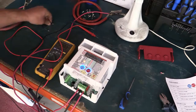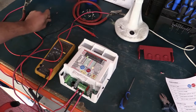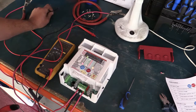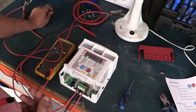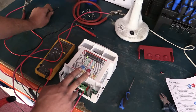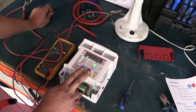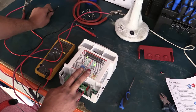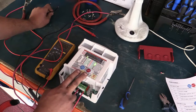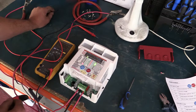As a word of caution: a factory reset will completely remove any custom settings you've made on the unit, so you'll need to redo those afterwards. It's also worth mentioning that you can try just toggling the unit back on rather than doing a full factory reset. However, it's easier and more reliable to hold the buttons for 32 seconds and do a complete factory reset - you know the unit will fire up and behave exactly as it came out of the box.